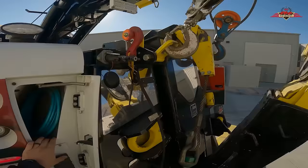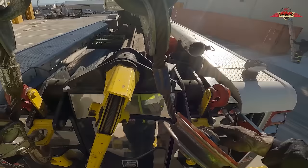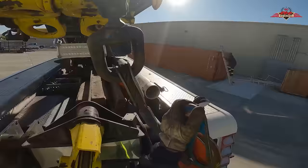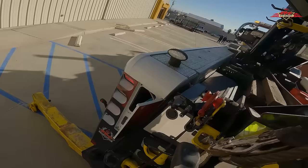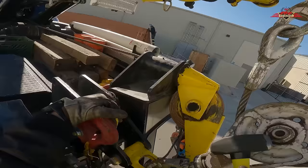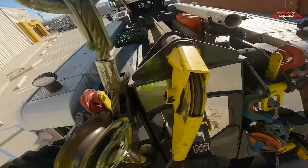I'm going to get all the outriggers out. We're on concrete and dealing with a lightweight load, so I'm not going to put pads down. I think I'll single out these lines — we're kind of far away so we'll need the extra headroom. I'm going to unthread the snatch blocks. Take these two and thread them into the top corners.